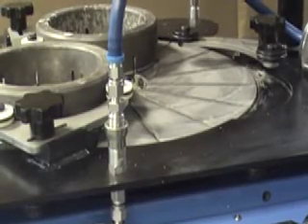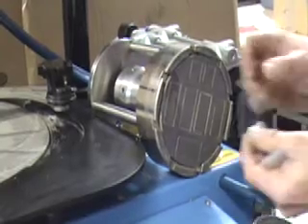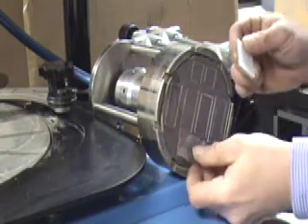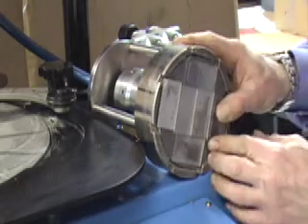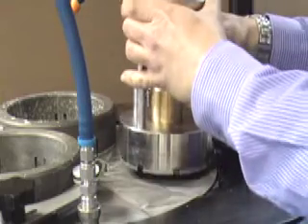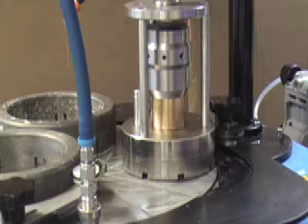Connect to the vacuum circuit, turn on the vacuum circuit and turn on the vacuum pump, and mount the slides to the jig. Every position must be covered to enable the vacuum to hold the slides. Then place the jig onto the lapping machine, ensuring the correct yoke rollers are in place — these are the large black ones.